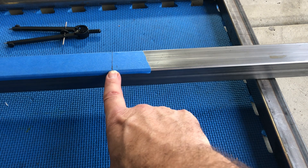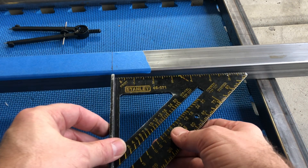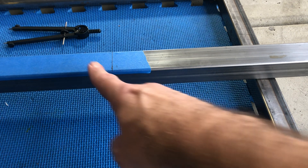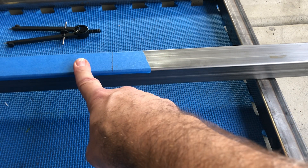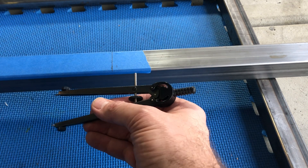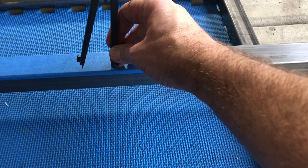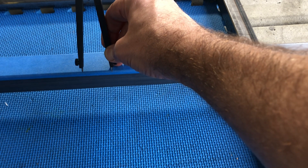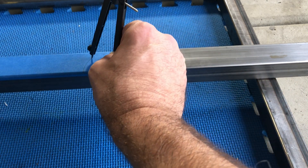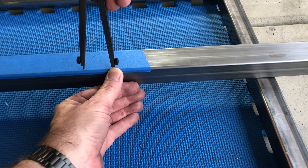This is where I want my inside corner to be. I want to take this piece and bend it around this way — basically this is kind of what I'm hoping I can get out of the thing. I need to cut some stuff. If I want to keep this one piece of steel, I can also have a nice beautiful rounded corner here. So I want to see if I take my inch-and-a-half radius, I can get a nice beautiful turn.